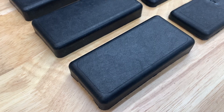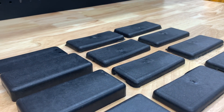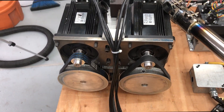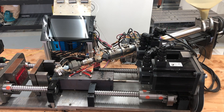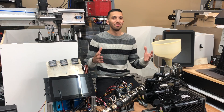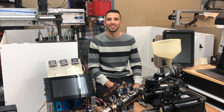Our fully automatic desktop-sized plastic injection machine features two massive three-horsepower motors for injection, dual stepper motors for mold clamping, 30 millimeter ball screws all around, and the best part is that it's 100% electric. If you enjoyed our build, like and share this video and stay tuned for similar content.